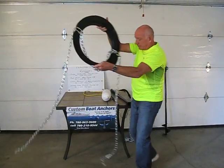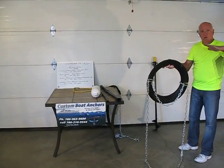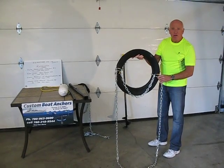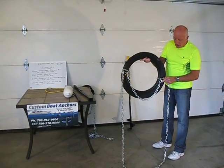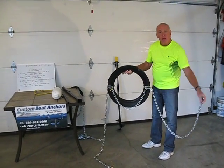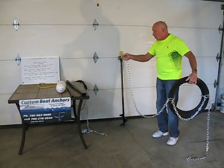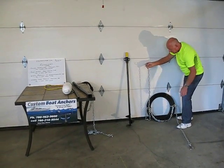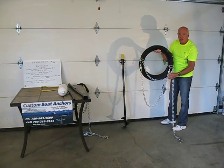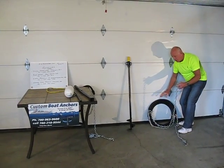Now that you have your softener — a boat in the water in a storm will do a lot of bobbing, and a solid chain will not do the trick. It has to have a softener to break the shock. On one end that goes to the boat, we have a locking stainless steel carabiner. On the other end, we have the mechanical link that goes to your anchor. We also have a safety chain so that once this is stretched out and if this happens to fail, the chain will take over. But do not operate it without the softener.